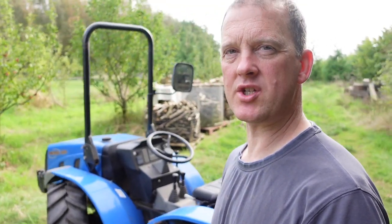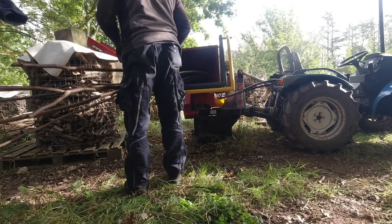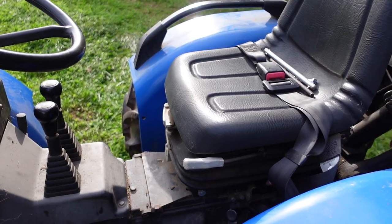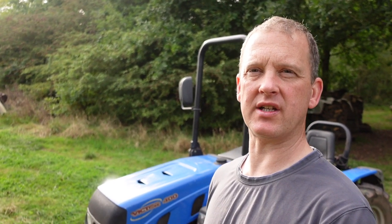With any machine, a common question is how much fuel does it use. If I've got my little log splitter attached, I use it on just over tick over, and I can use that all day — about eight hours — for about a gallon of diesel, sometimes a little bit less or a bit more depending on how much work I give it. If I was to use my branch logger, which takes a little bit more torque to run, that will tend to use just over a gallon to about one and a half gallons of diesel in a day. But if you were to run something like a flail mower, which is quite a high power requirement, you may end up using somewhere around two to three gallons of diesel in an eight hour day.